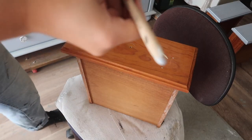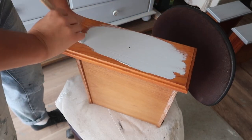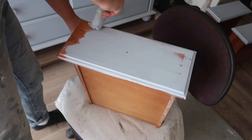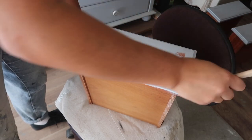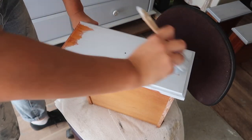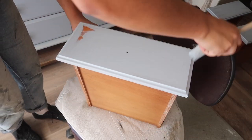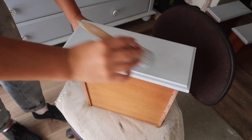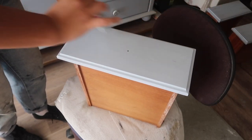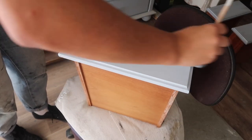If this is your first time working with chalk paint, it usually is a little bit thicker in consistency, so you don't want to overload the brush with too much paint. It's always best to do light coats — that's where you can get excess blobs forming on the corners. Make sure you're always going through the sides and then the center to clean up any streak marks as you go. Then do a light feathering over the top to get nice smooth, even strokes.